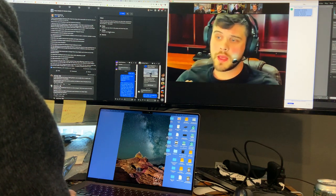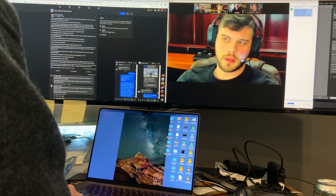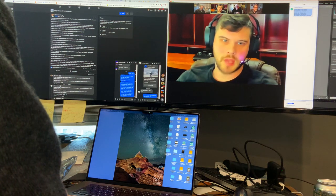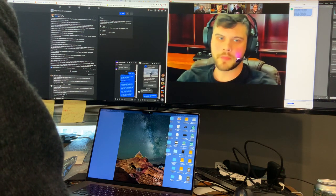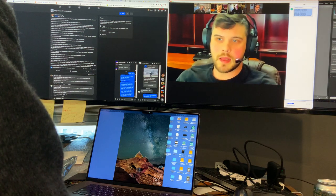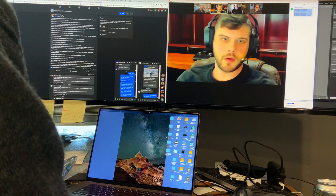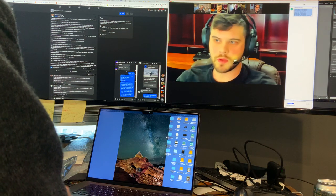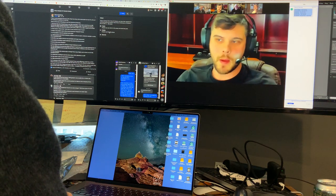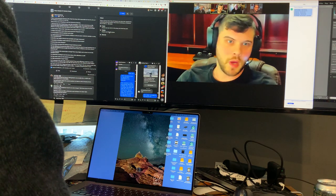So the Airpeak is on a different kind of level with collision avoidance. It's not like DJI collision avoidance. It's using SLAM algorithms, so simultaneous localization and mapping, similar to what the Skydio uses. Only Sony has its own proprietary SLAM algorithm, its own proprietary processor that it's using to determine its location and map the location in real time. I'll say this, it can see beyond 50 meters away.